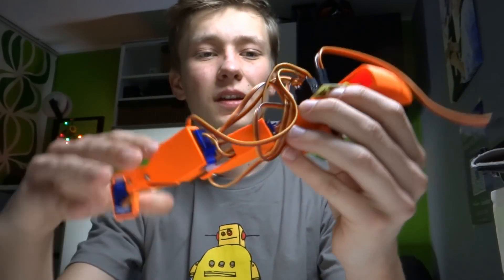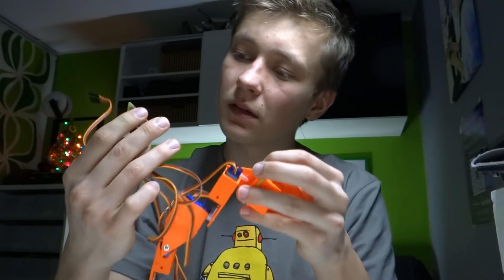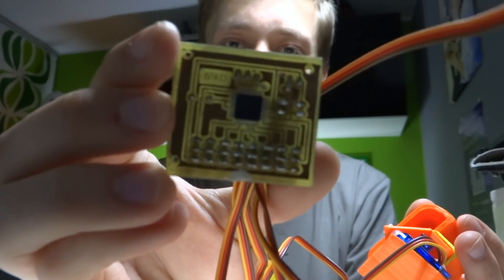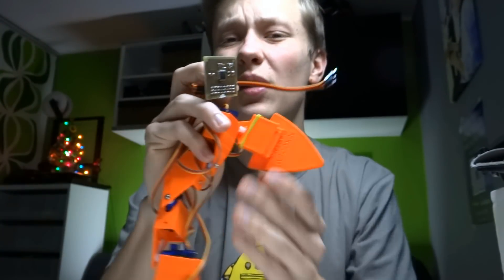Let me show you — here is my snake robot, and here is the PCB for this project. Right there is the Atmega 328, and I soldered that and it really, really works all the time. So I think soldering to this PCB will be simpler because it's more professional. With soldering paste it should be much, much simpler. These days SMD components are everywhere — they are cheaper, smaller, and SMD soldering is very important. This project is a perfect opportunity to learn this.